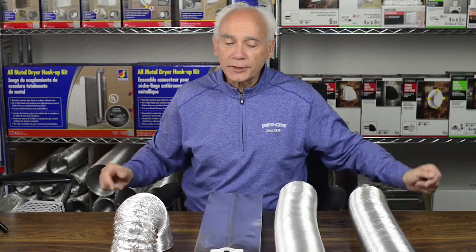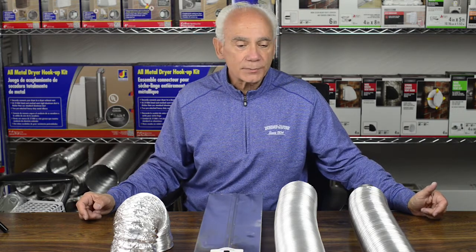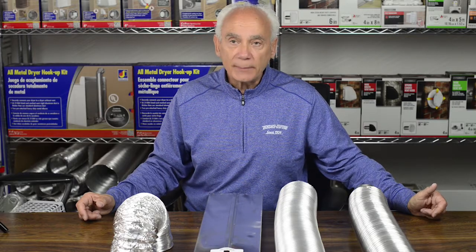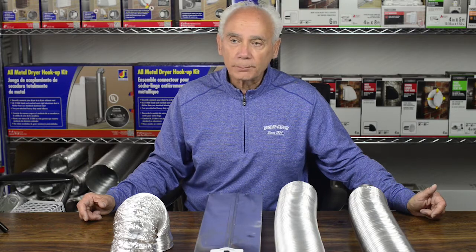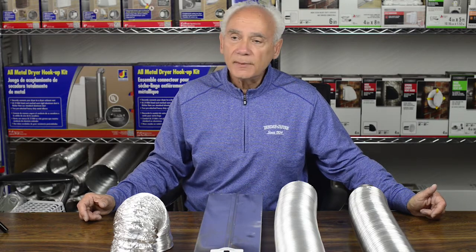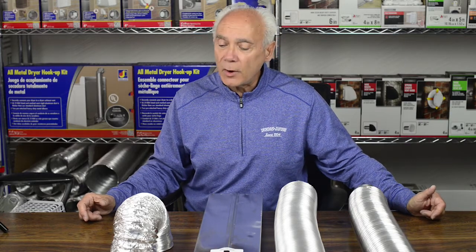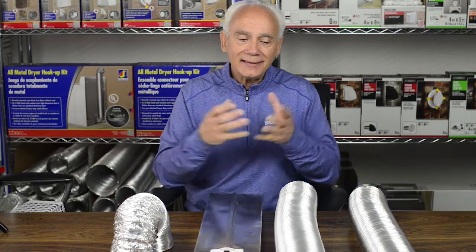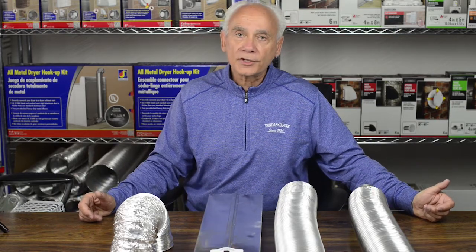In this segment, we're going to talk a little bit about dryer ducting. Now, there are some specific requirements when it comes to dryer ducting. One of the things that every inspector is going to look for is that the product being used is UL approved, UL certified, which means it needs to go through a number of different tests. The types of tests that are required are a puncture test, a torsion test, a fire test, and a test that demonstrates that the product will not come apart on its own over the course of time.